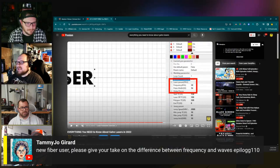Yeah. Tammy Joe says, new fiber user, please give your take on the difference between frequency and waves. Epilogue 110. I'm guessing frequency and wavelength. Wavelength is the wavelength of the laser that you're using. So fiber would be like 1064, CO2 would be 10,600, UV would be 355, and a diode laser would be 455. Just as an example. And then there are specialty lasers that fall outside of those ranges for very specific use cases.